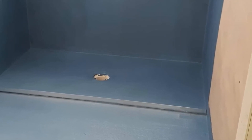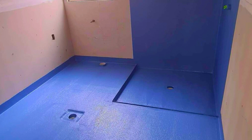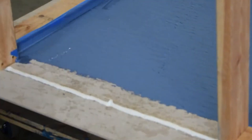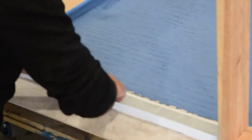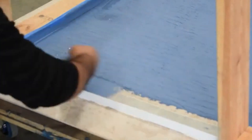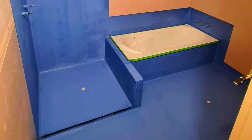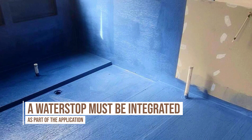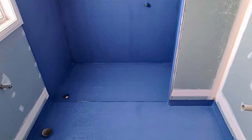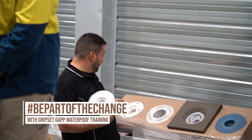There's no compromising on that water stop. The other area where water stops need to be looked at — and this is where we see it so often ignored — is at doorways. We often forget about installing a water stop at the doorway of a bathroom area, particularly when screeds are installed. Sometimes we just see a plastic or metal angle siliconed over the membrane before the tiles go in. And if there's ever a flooded floor, we so often see architraves and carpets outside a bathroom starting to get wet because there's no water stop sealed as part of the membrane system. It's an afterthought, and it needs to be integrated as part of the application.